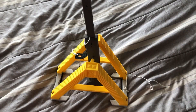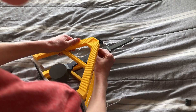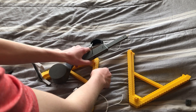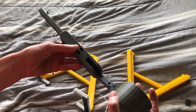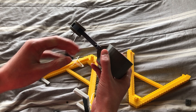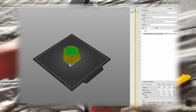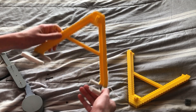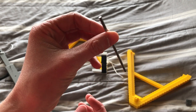And there we go — it's all the way through. Now that the screws are out, you can literally just take this entire thing off like that. And you can slide this off, which you can see is just one solid piece as well. This right here was actually printed as one solid thing. In the slicer, I was able to pause the print right here as if it was a color change, and then inserted a whole bunch of screws and weight so that it's actually pretty heavy. But then it's just a replica on the other side, and a simple little rod. This little rod is what makes this entire thing work.